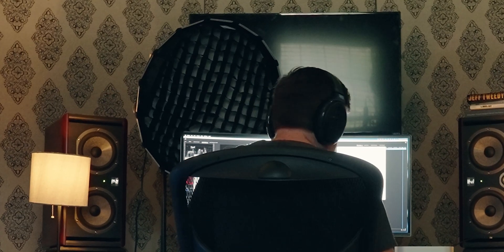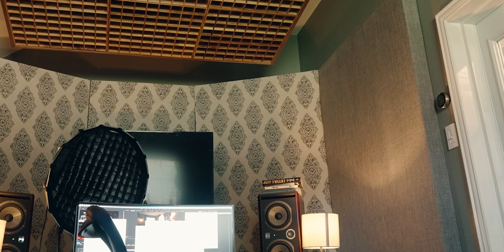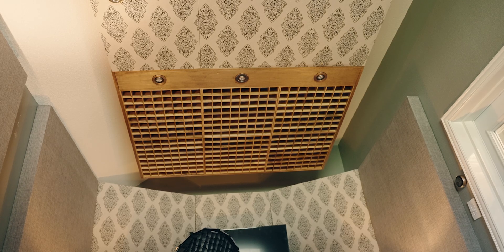The things that are on my desk, including this giant light — well, I make YouTube videos, so that light's got to be here. So I might as well run the correction with everything the way my room needs to be set up for me to get the job done. I have some fairly thick traps at the front part of the room, very deep in the corners — like 18 inches deep. I have two-inch rigid fiberglass with an inch-and-a-half air gap on the sides. I know that's probably okay for reflections, but it's not doing a lot for low frequencies. I believe the next obvious step is to do some serious bass trapping on that back wall.